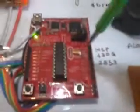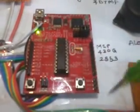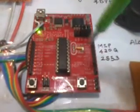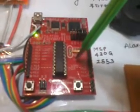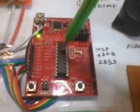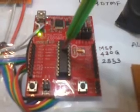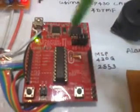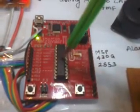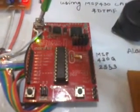Here I am using an MSP430 G2553 — it's a LaunchPad. And here it is called a reset, and this is a push button. Here they are using a 32.768 kHz crystal. The crystal is the heart of the circuit for the microcontroller to generate the clock pulses to the internal CPU to run the program. And here this is an emulator circuit — so we want to dump the program onto the controller. This is a USB; otherwise you can use the USB power.